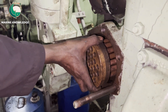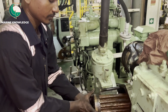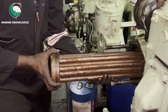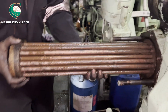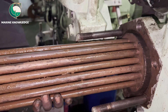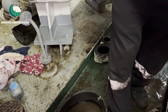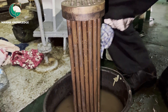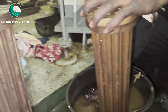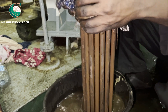Check the condition of the O-ring. If it is okay, reuse it; if not, change it — no issue. To take the cooler out, push from one side and you can see the cooler protrude out. Take it out very carefully so that the flange edge does not damage the tubes. These are copper tubes. Do not force anything — just a little shake will get it out.